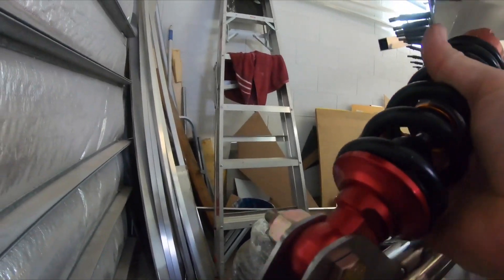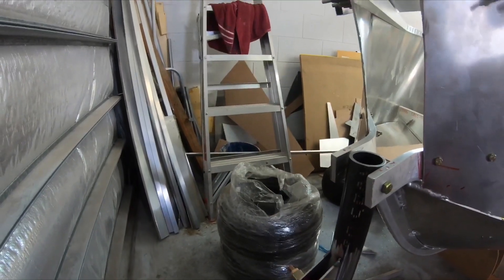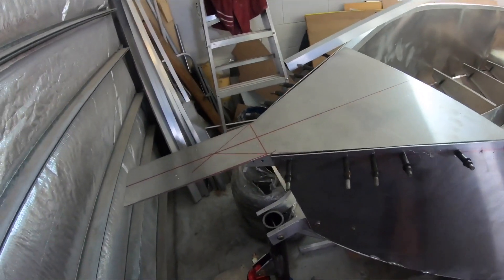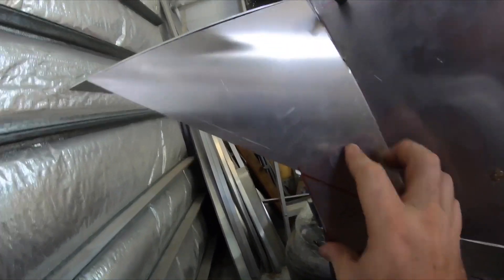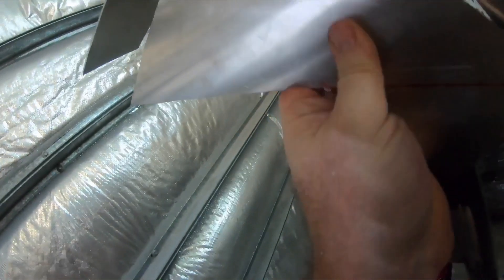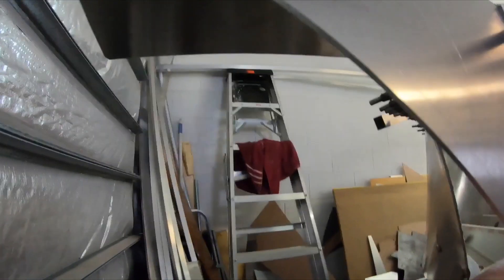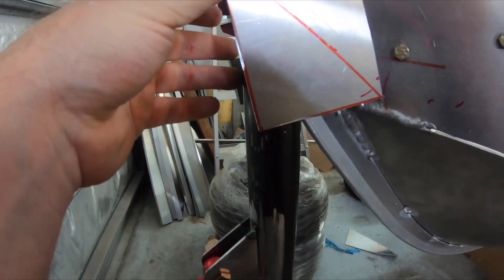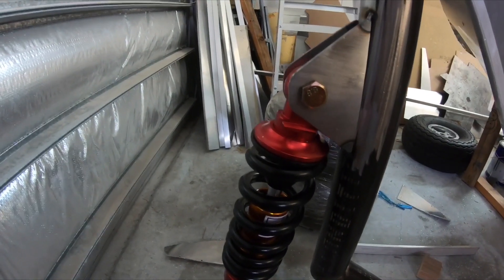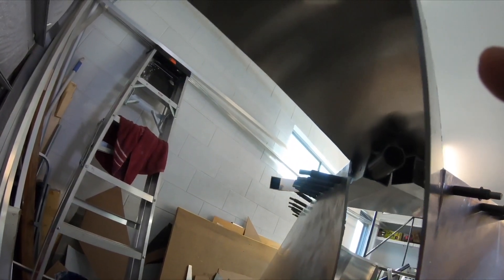I've created a hole so that it pulls up and into there. It'll be boxed out. On the top I've got this fitting, and on the side this will pull in once I put the bracket on. Inside here is going to be a welded chromoly bracket which will stiffen the whole lot up, tie everything together, and mount the top strut too.